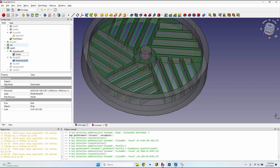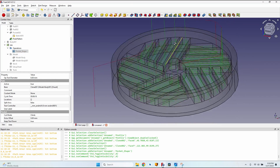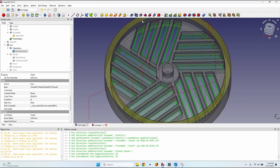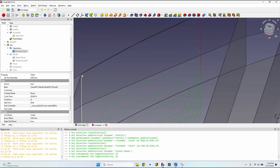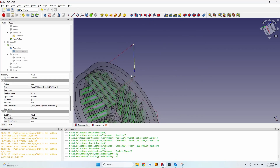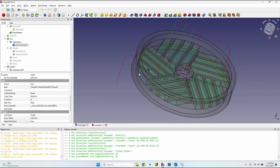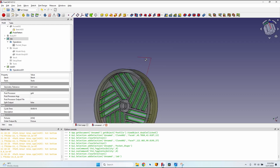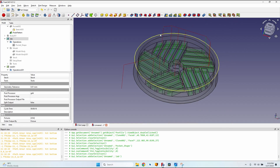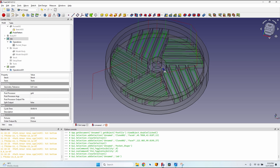So I have two jobs: the first mills the entire face of the piece removing a lot of extra material, then the second operation removes all the material in the slots. There's a 0.01 millimeter hack which won't be visible on almost any machine. I'll need to rotate the piece on the CNC and repeat the first job — this shows why having two separate jobs is a good thing. I can reuse the file from the first job, rotate the piece, mill it again on this face, and the part is ready — almost. I still need a profile on the outside, but that's simple. Thank you for watching; I hope it's helpful and solves the problem for the person who asked.